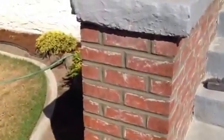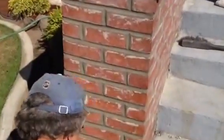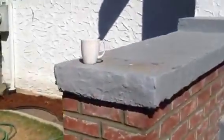We had to do that until we got it right, and then we wipe it off. Roland's been going along the edges taking a white cloth and just taking the excess mortar off. Tomorrow we'll wash that with a little bit of muriatic acid and spray it with the waterproofing.